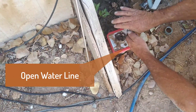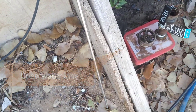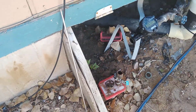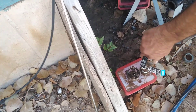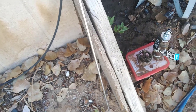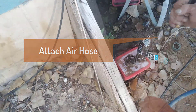Next he's opening up the water line. You can see some water coming out of that area. Now he is going to apply the fitting that actually had the hose bib on it for the house — we've taken the hose bib off. That's a three-quarter inch male fitting that fits right in there, and now he's going to hook air up to it and blow it out.